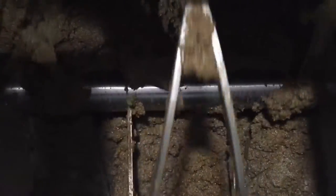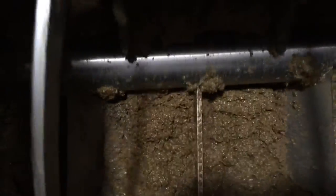This part here is the key to the whole process. These are the decanters where the olive pulp is actually churned for about 45 minutes to an hour, depending on the amount of olives and their doneness. The olives are turned — this is a blend of the whole olive: the skin, the pulp, and the pit. You can see the glistening — that is actually the unfiltered or raw olive oil being turned from these olives. Very few people have actually seen this, but this is the very early stages of your extra virgin olive oil and where it comes from.